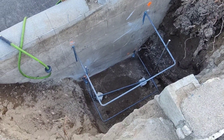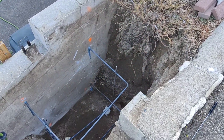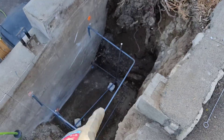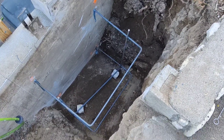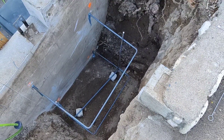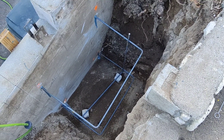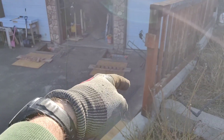There's one more footing over here on the far side of this retaining wall — this is the largest footing, almost four feet deep. Dirt tends to always collapse, and the rosebush I still have to pull out has turned into a massive hole, but we're just going to fill it with concrete. The plans only called out for 18 inches of rebar with some dowels top and bottom, but I turned it into loops and added a vertical as well. I'll put a couple more dobies down there — those little concrete blocks to keep the rebar off the ground so it won't make soil contact when the concrete is poured. So two footings there, two footings there, one over there.